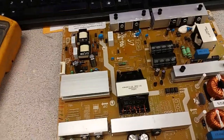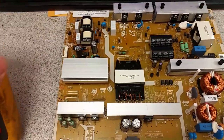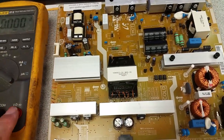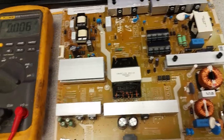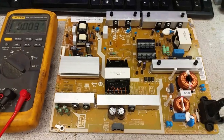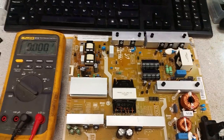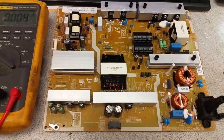This is true for most Samsung LED boards: the first and foremost thing you need to know is that this is 99.9% reliable — not 100% — because it is not being tested in a live set, meaning there are no loads on the output voltages of the secondary side circuits. In about 0.1% of cases the board may misbehave when you actually load it. For practical purposes it is definitely not worth testing every single board in a live set unless there is a well-known tendency to develop such a problem.